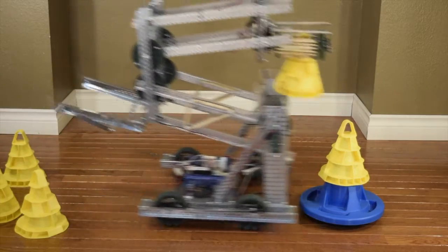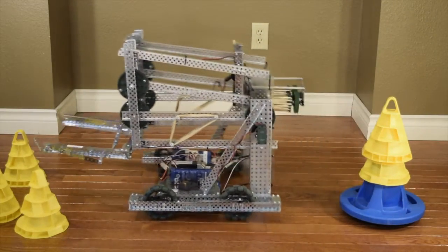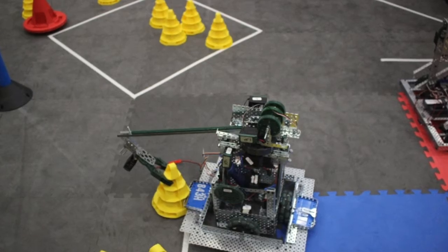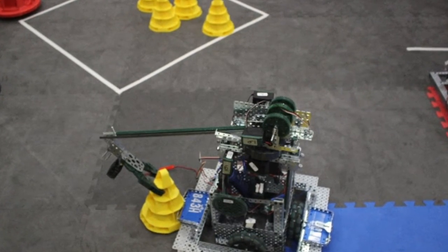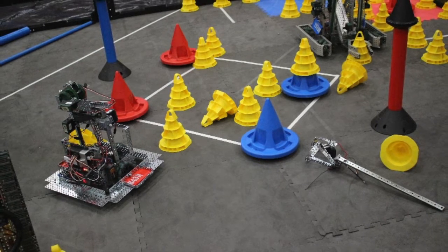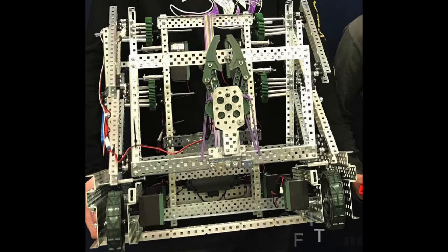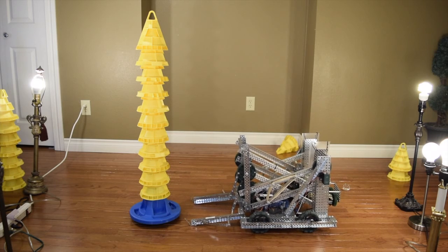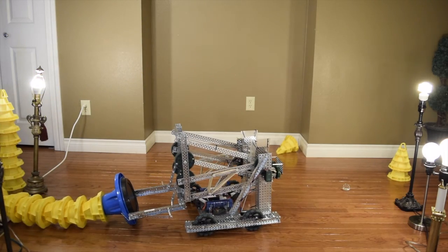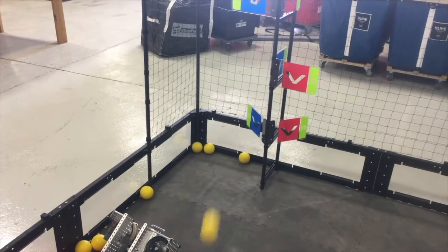Tip 2: Go to as many competitions as possible. I've found that the more competitions you go to in a year, the better your bot is by the end of it. Last year our robot began as a pretty bad holonomic drive with a two-stage arm that would fall off all the time. After that competition we tore it apart and rebuilt it as a 6-bar lifter that could actually stack cones. After that we replaced it with an 8-bar, and for state we built a double reverse 4-bar with a mogo lifter. The more competitions you go to, the more ideas you're exposed to and the more you realize the shortcomings of your robot.